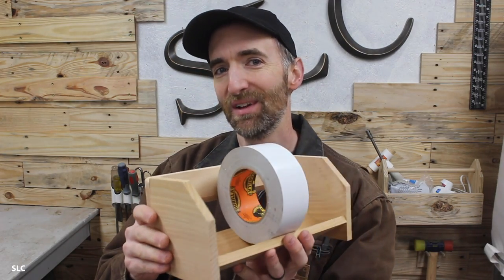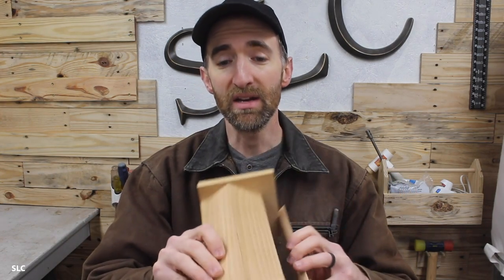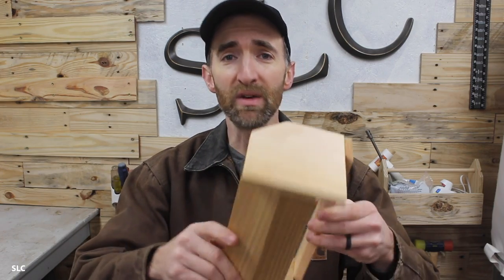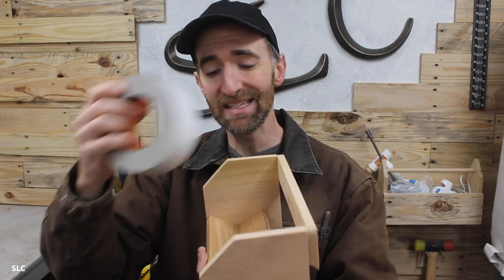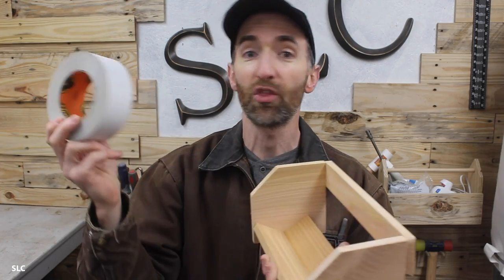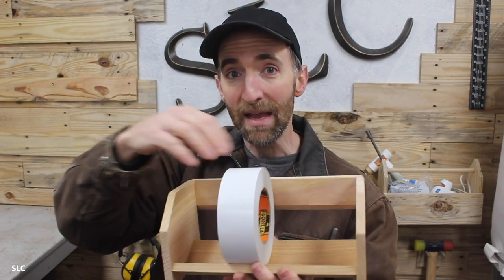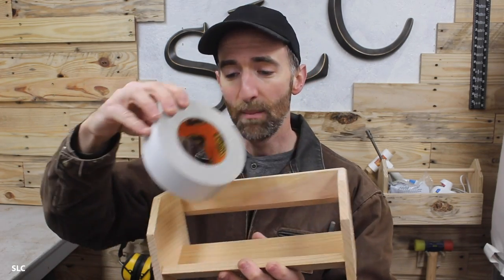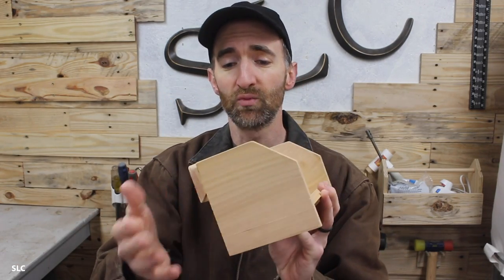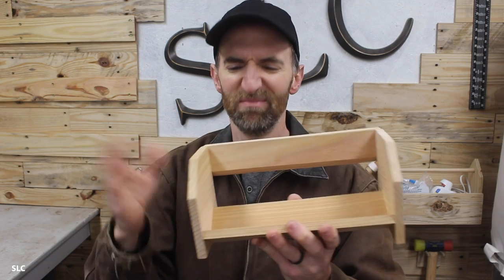Next up is this awesomely simple little tape holder. I use cedar, but you can use whatever kind of wood you want. On the bottom, I created a little shelf using two pieces of wood cut at about a 30-degree angle. That creates a nice wide mouth so you can easily store your tape — it allows a variety of different sizes to fit in there well. As long as you're not just throwing your tape in, you just quickly set it in and it's almost going to center perfectly for you. Make it wide enough to have a variety of tapes — mine holds about six or so pieces depending on the sizes. For the sides, just real simple — again, just some cedar, use whatever you want. And of course, your French cleat on the back. Real easy, real simple — go out and make one.